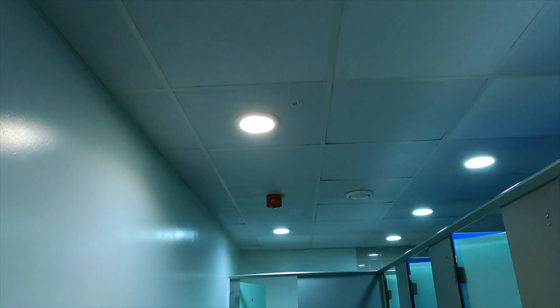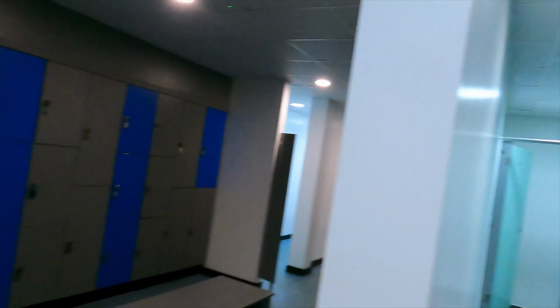So yeah, I'm gonna get above these ceilings. I'm assuming they'll still be on a Click plug and start swapping these out. I think we've got 9 altogether to change in the building. Obviously, I think there's two in here. Distribution board there, but if they're on a Click plug, I can safely isolate it just by unplugging it. So I'll do that because I can't really turn many lights off in this place anyway because it's open.